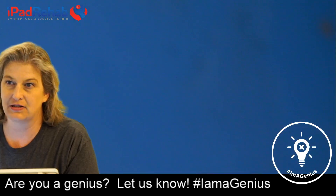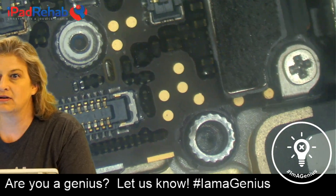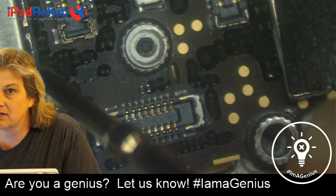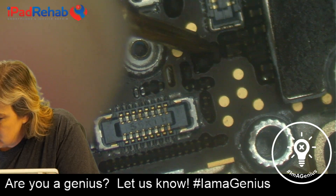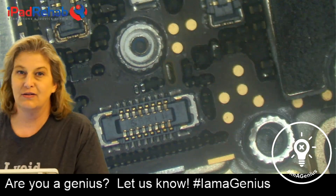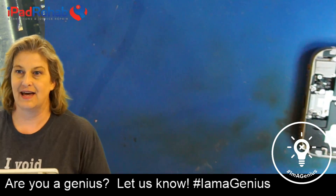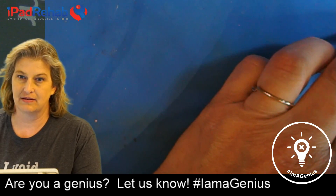Switching to the microscope view, I like to measure VCC main right next to the camera LDO — there's a little spot there. Grabbing the multimeter, I put a probe on ground and measure this VCC main cap. You can hear a beep to ground on both sides. I don't love the continuity method for confirming shorts, but in this case that is indeed what's going on.